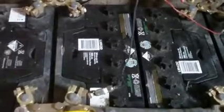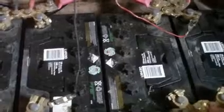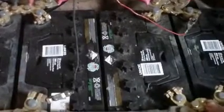The second thing is that you obviously can't really deep cycle them. So the usual rule, of course, as we all try and adhere to with our solar setups, is to not take a battery such as these crowns or these gels, anything really, down to less than 50%.